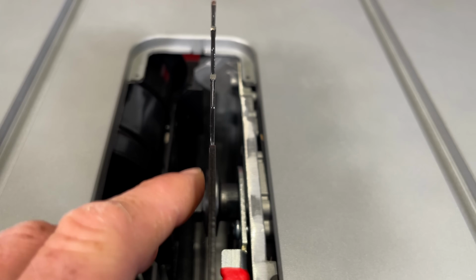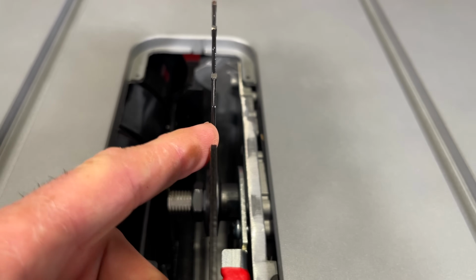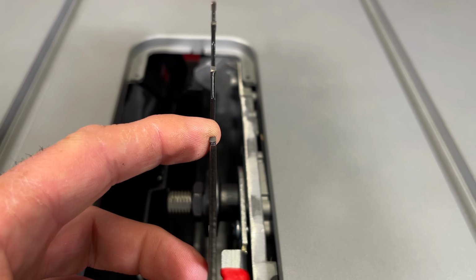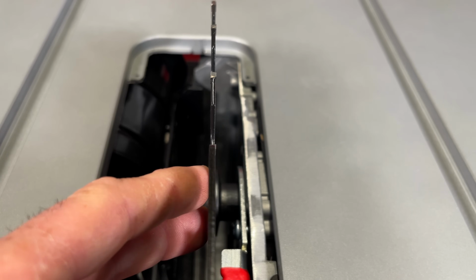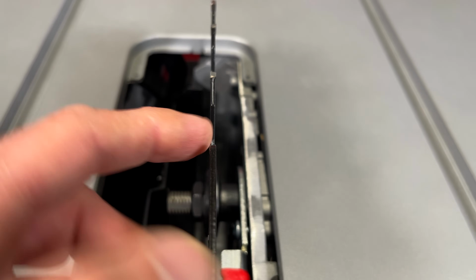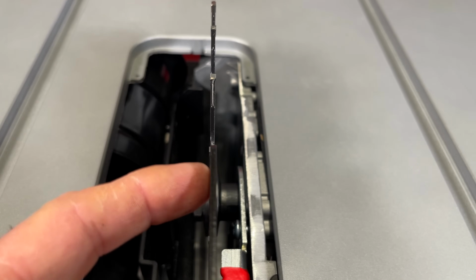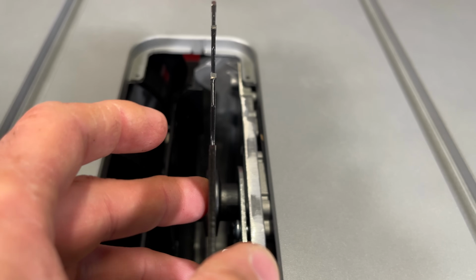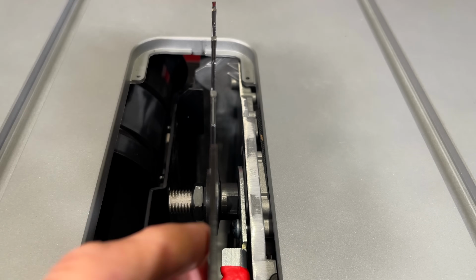Here is your Riving knife. This is always difficult to show you guys. Carbide teeth here. And as you can see, it is off, but it's, man, just the tiniest bit. And it does not protrude past the carbide tip on this side, even at the highest point here. So I'm gonna call this acceptable. And one of the straightest ones I've seen out of the box.